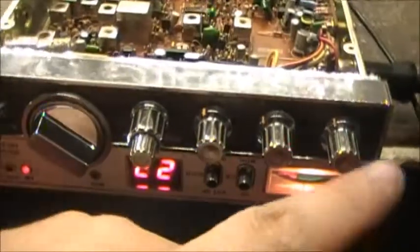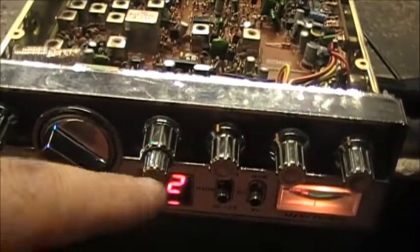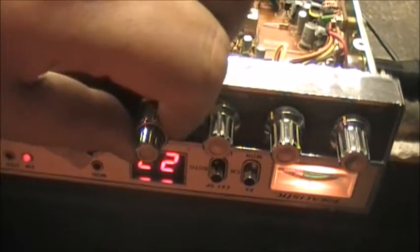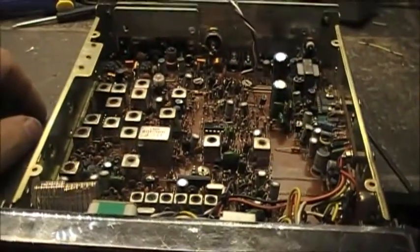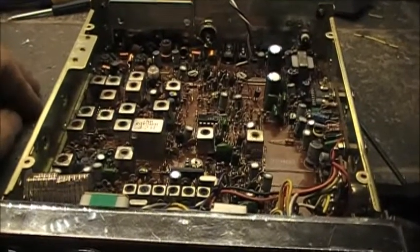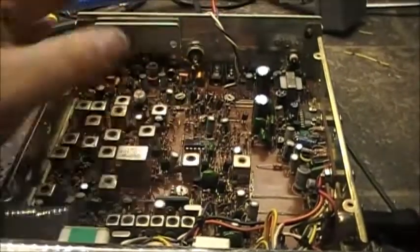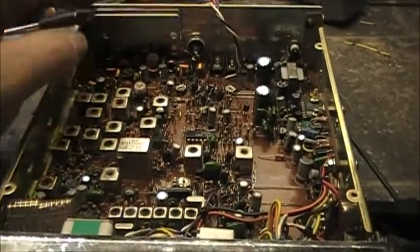I have confirmed that the volume control is working, the RF gain is working, the noise blanker is working, and the squelch is working. The dimmer switch is kind of messed up — I'm going to see if I've got another one to put in there. The receiver is hearing the signal but it's very weak. I'm thinking something is taking the signal from the antenna and shorting it to ground, not allowing it to fully go through the whole receiver circuit.